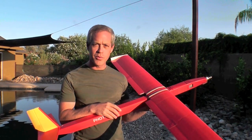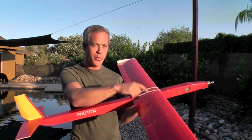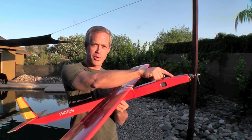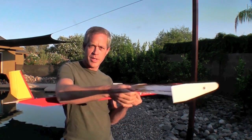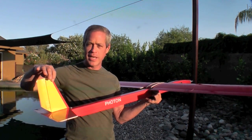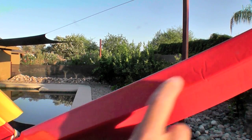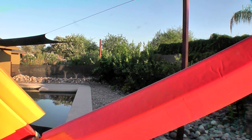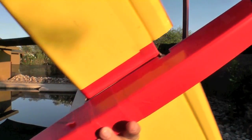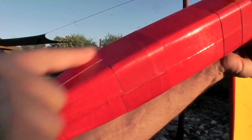The construction is really not that much more complicated than a simple plane such as the Noob Tube, except that it uses two wing sections and takes advantage of some embellishments such as the tapered nose, the kissing tape technique for the trailing edges, the wrap around technique for the leading edges, just to get the greatest possible performance. All of the exterior is pre-covered with colored packing tape — I get mine from tapebrothers.com — with sparing use of duct tape where needed for covering contours such as the nose taper.